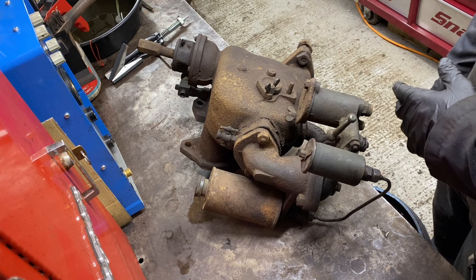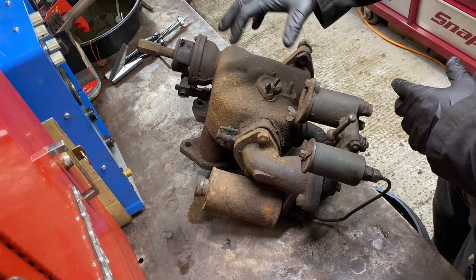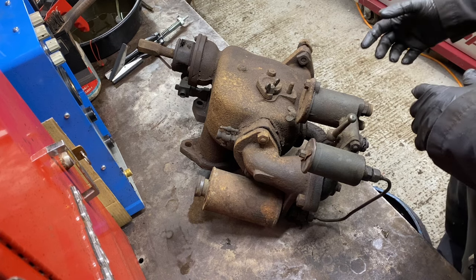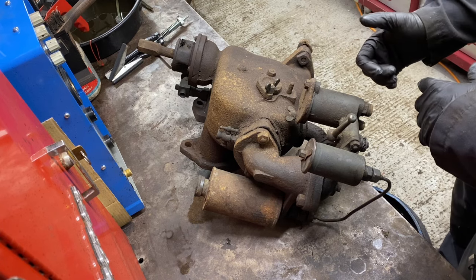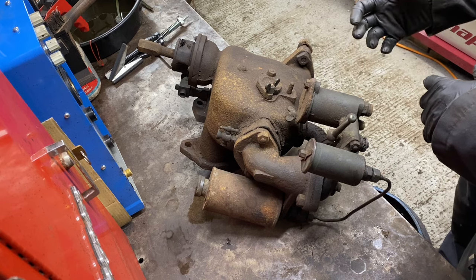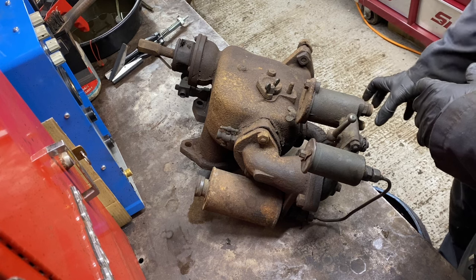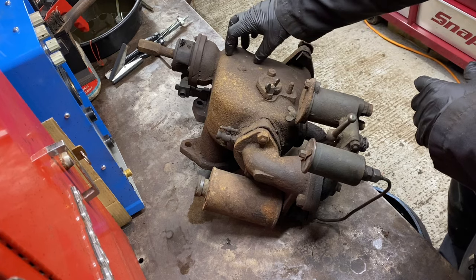The Style 1 was much more elaborate, had basically pipes coming out from all over, and all this bowl system was hung much lower. They ditched it because one, it wasn't very efficient, took a lot of getting warm, and two, the fuel flow through the vaporizer was quite hard work, particularly getting them started, because you had to draw the fuel from down here all the way up and in, and then basically only heated across here.